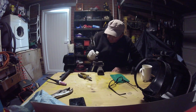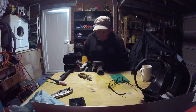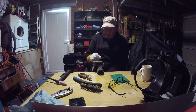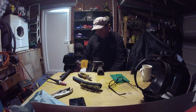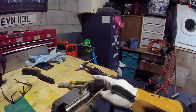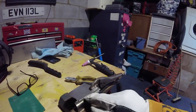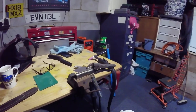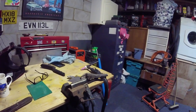I've gone all over the place and can't even get a straight run. Let me try welding another piece of steel to this piece — maybe that's going to make a difference, like a lap weld or something. I've just laid this piece of steel on here, put some clamps on top, and I'm going to try and fuse these two together without any filler wire.